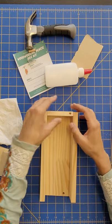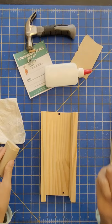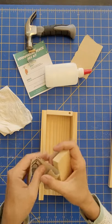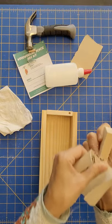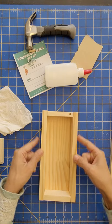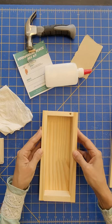So let's mock this up. You can see a little bit of a mark from the table saw blade when we trimmed this wood — it left a little bit of a mark called a machine mark. This is my end piece. I can also just take the sandpaper and keep my finger really flat; I don't really want to round over the edges on this, I want everything to be pretty square. I'm gonna put this in like this and this in like this. I really want to make sure that I'm lining everything up as much as possible with the bottom piece, and this feels like it's gonna go together pretty well.